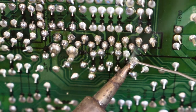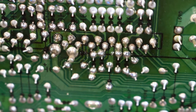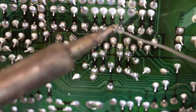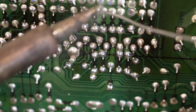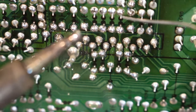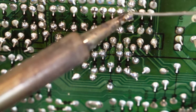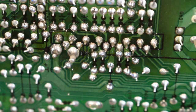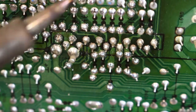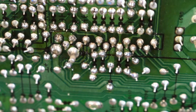I'm pretty much at the stage where I could chuck this amp out, but it's a good little project in resurrecting something. Just to give you an idea of what needs to be done - even that pad below it, which could be a resistor on the other side - is in pretty awful condition. The way it's bent is almost going to cause a short. I don't know why they've done it like that in the factory. That end pin has opened up on one side as soon as I touched it.